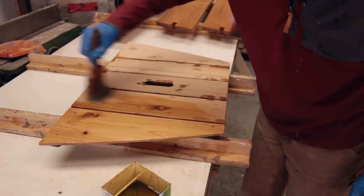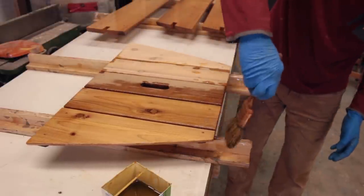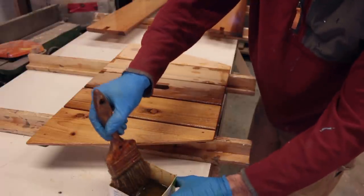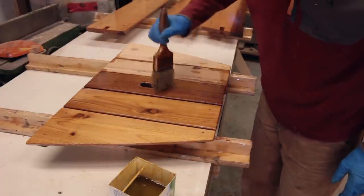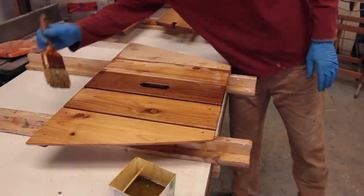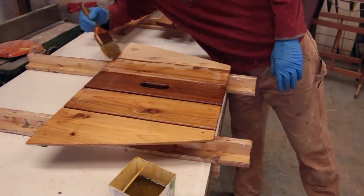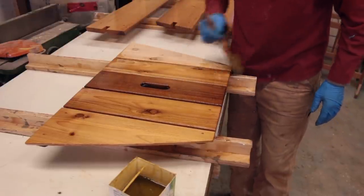One simple recipe is called the 1-2-3 recipe, and you can use this either way you want. Either you can go with 3 parts solvent, 2 parts oil, 1 part pine tar or varnish or combination of, or you can flip that around. You could use 3 parts varnish, 2 parts oil, 1 part solvent. The ratios that you use are going to affect the results, of course, but they all work.